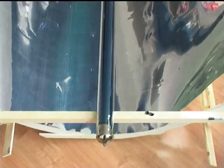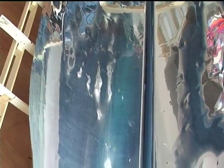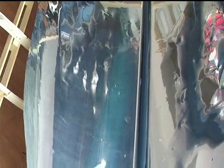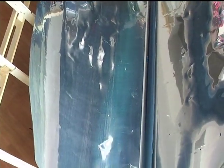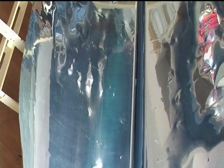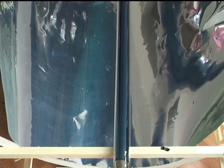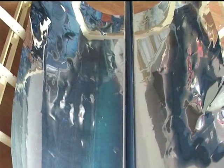So I made a support for the vacuum tube and here I can show you that the mirror is actually focusing on the tube. Because here on the left side where the mirror is curved correctly, you can see mainly the vacuum tube — the blue of the vacuum tube — which means that the parallel rays of the sun will focus on the tube when they come down. So now I have to make the support and attachment for the vacuum tube.